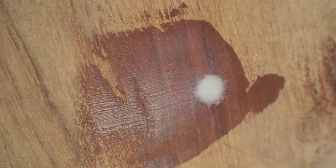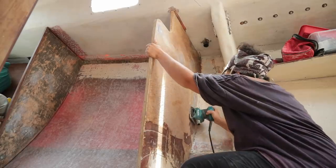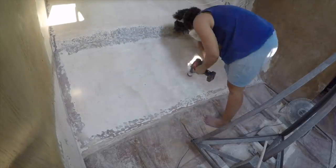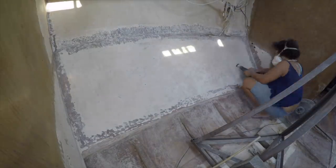Back inside the boat, there were tons of old holes from electrical wiring that I filled in with thickened epoxy, and now needed to be smoothed and sanded. The original gel coat would not necessarily have to be removed completely in a lot of places, but it would need to be wire brushed to help the new paint adhere to it.